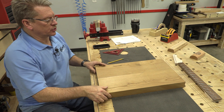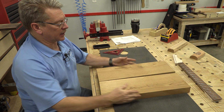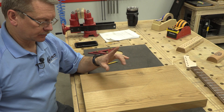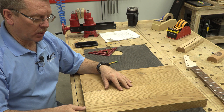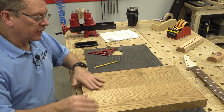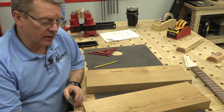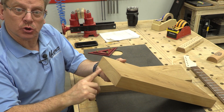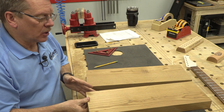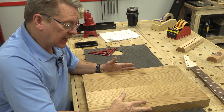When I fold this up, the V goes away. When I come down, I can line it up to be right where it needs to be — that's a good first step. The second step is where we flatten these two sides and then joint the edges on both sides. Assuming my jointer fence is square, I'll have a perfectly square edge from the reference side and the reference edge, which will allow this to glue up perfectly flat and tight.